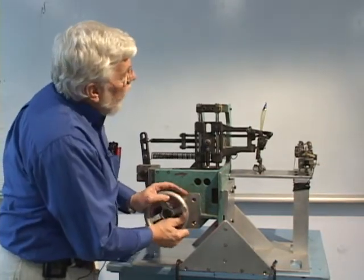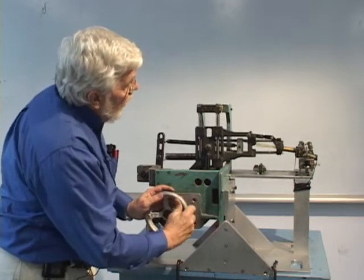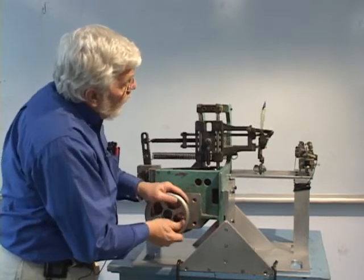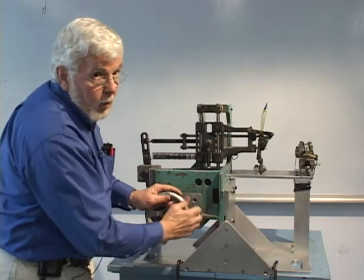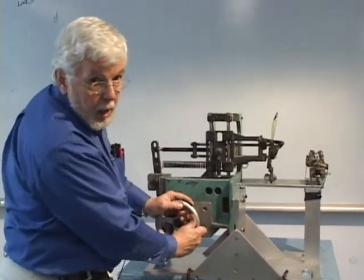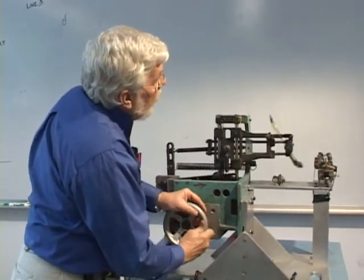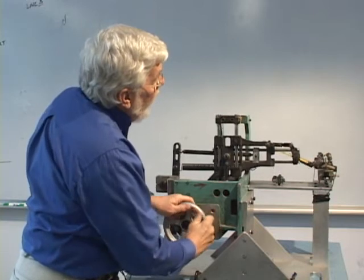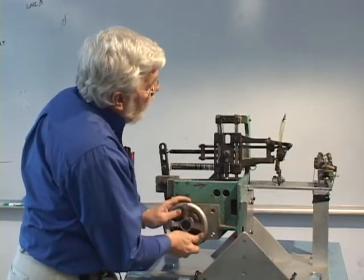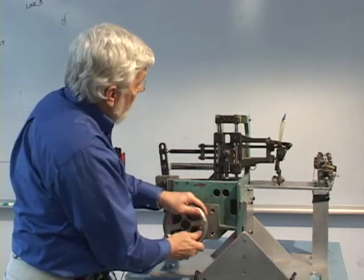and thus give you difficulties in your machine operation. Some of my students a couple of years ago redesigned this entire assembly and replaced it with what ended up being an 8-bar linkage driven by a single cam, which gave the same end positions and end angles and ended up being a simpler mechanism and much more robust and less vibration prone.